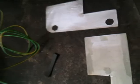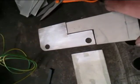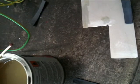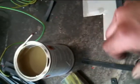I cut out 14 plates from the aluminum. I chose this design so all plates are exactly the same — nice and efficient, didn't waste any metal. I've now sanded them all, just roughly by hand. Using contact adhesive and these strips of rubber — cut from an old tractor inner tube I got from a tire repair place that was throwing them out — I'm going to put these in as spacers and insulators.